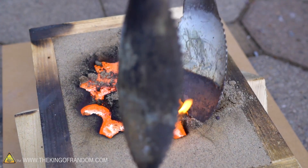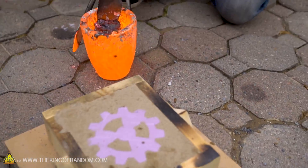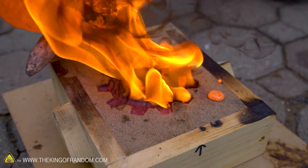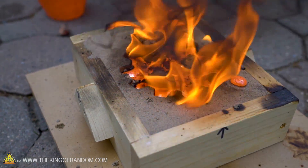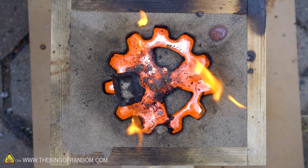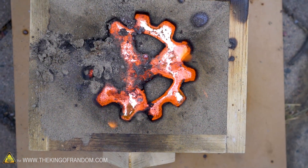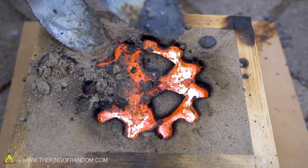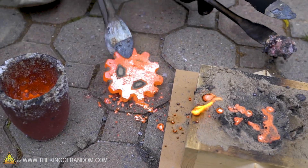At this point I'm a little bit lost. Burning out the mold didn't seem to make a difference — if anything, it kind of let the sand go and the sand flowed to the top. So at this point I've just gone ahead and made a new styrofoam gear. We're going to take the copper out, pour it as fast as we can and hope for the best. That looks toasty — quickly, quickly. That was definitely more molten, but another one of our little sand pieces came out. I wonder if that's because our green sand isn't quite stable enough. That is very, very frustrating. Everything about that was beautiful except this little chunk came out. That looks pretty cool though — that was almost perfect. So close.